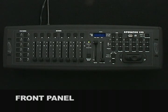Fixture 3 should be set to DMX channel 33. Fixture 4 should be set to DMX channel 49. Fixture 5 should be set to DMX channel 65. Fixture 6 should be set to DMX channel 81. Fixture 7 should be set to DMX channel 97. Fixture 8 should be set to DMX channel 113.